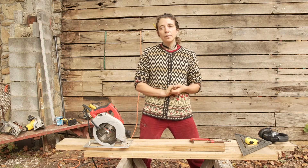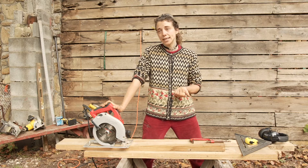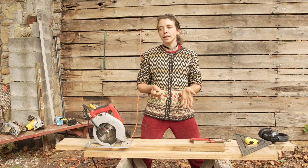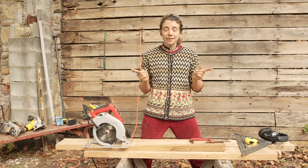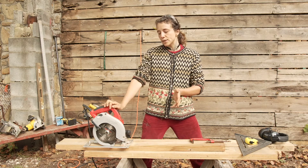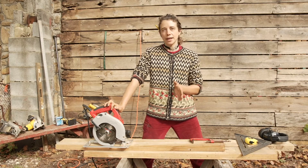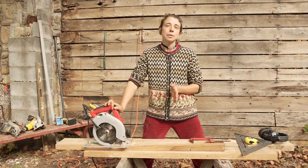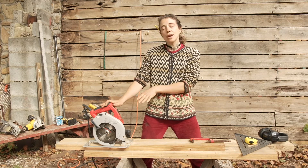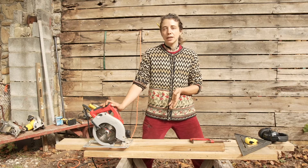I want to note that this tool is really amazing because it can do all the things — it can do cross cuts, it can do rip cuts. We've looked at some of the other tools like the compound miter saw or the table saw which can only do one thing. Your miter saw does your cross cuts, your table saw does your rip cuts, while this saw can do all of these things. However, the miter saw is going to be way more accurate at cross cuts, and if you have to do a bunch of ripping, the table saw is going to be the more suitable tool. So it can do everything, but it just doesn't do it quite as well or as easily as the tools made specifically for that purpose.